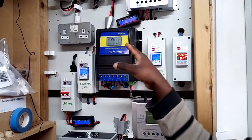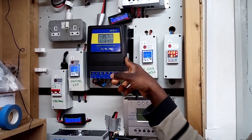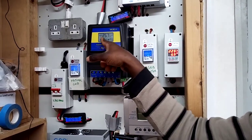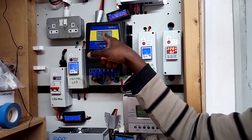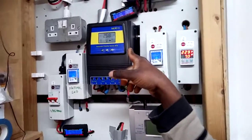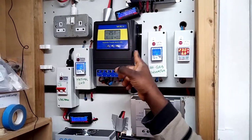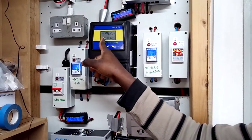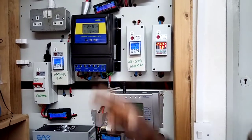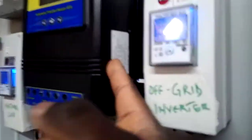Something I really want to share about the description: when you see '11 kilowatts' listed, that 11 kilowatts is not for everything — it is only for the national grid. It means when running on the national grid it can handle up to 11 kilowatts, provided your national grid voltage is 220 to 240 volts. For people in America using 110 volts, you can only do 5.5 kilowatts on the national grid. That rating is just for national grid mode, not for inverter mode.